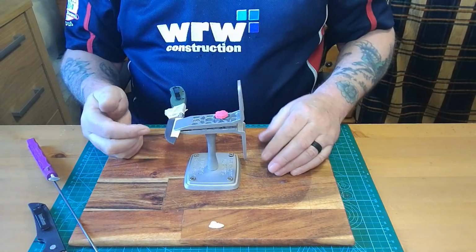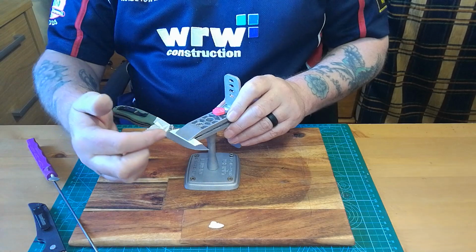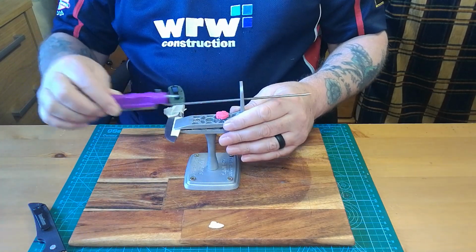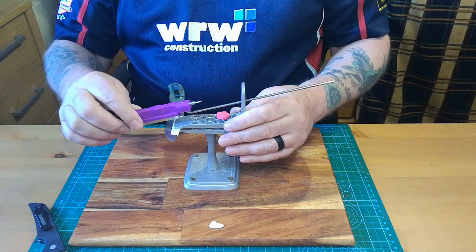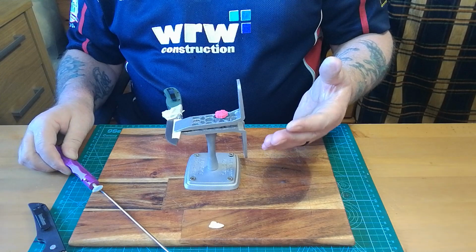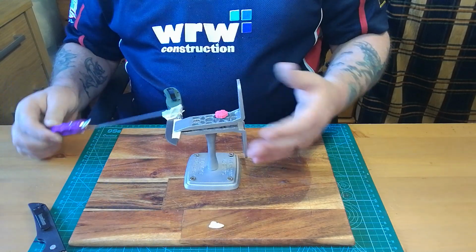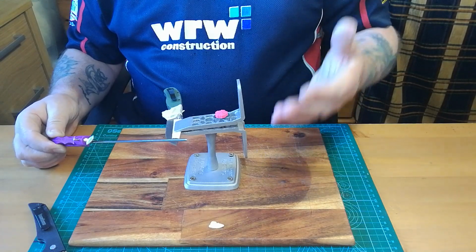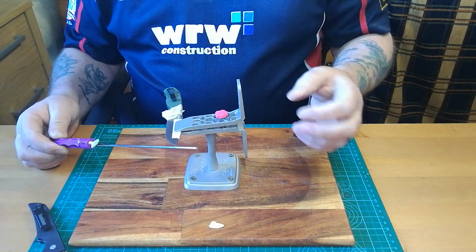Then it's the black marker, and I'll do that the next time. I'll do the black marker, and we'll start sharpening. We'll see if we got the right angle, because if you've got a really obtuse off angle on it, it just takes forever and you're losing a lot of metal. And what you want to do every time is lose the least amount of metal you can.